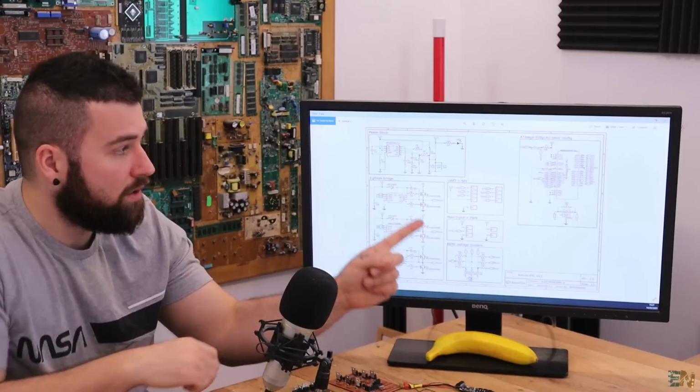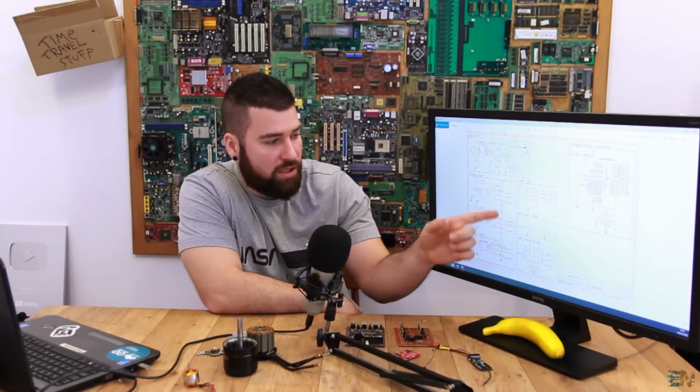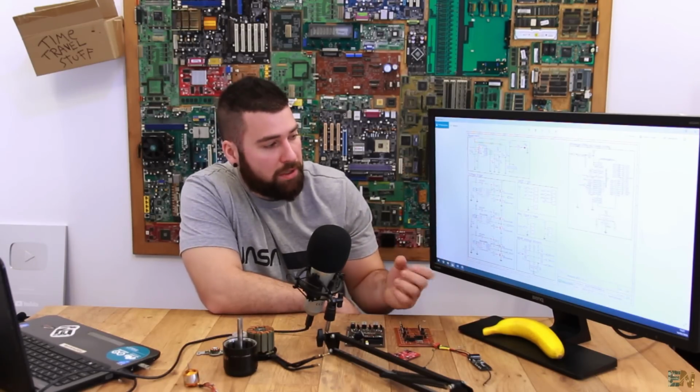Change the voltage divider, change the power control, be sure that the voltage that the drivers can apply to the MOSFETs is good. Also, you can add more MOSFETs in parallel to increase the power.